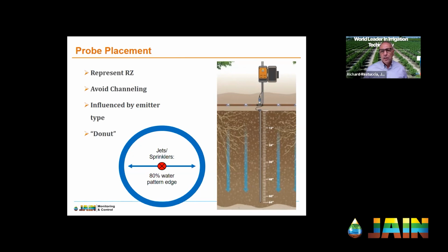So these volumetric soil moisture sensors, the ones that you particularly like, can tell you EC, which you can use to not just watch salinity in your soil, but manage your fertilizer, as well as soil temperature. Well, really the biggest thing for me is being able to look at multiple points within our root zone, because we're not just managing one depth. With these other probes, they might be a little bit more cost effective up front, but there are other costs associated with it.